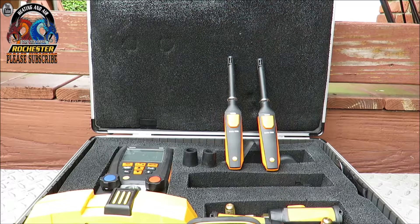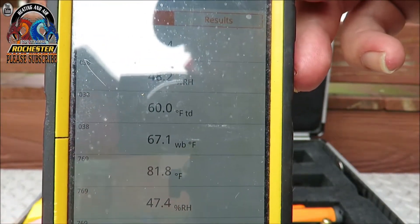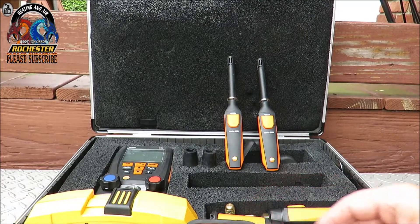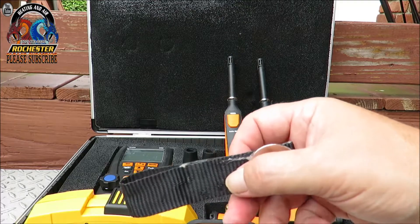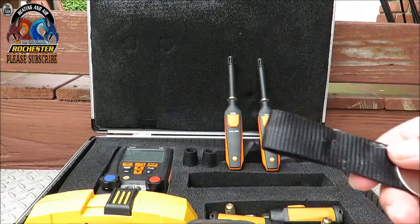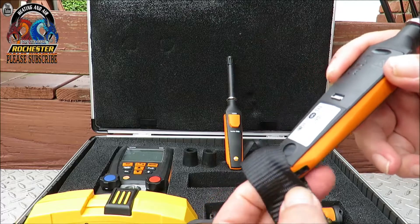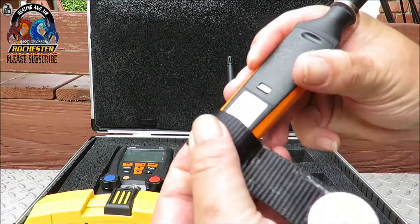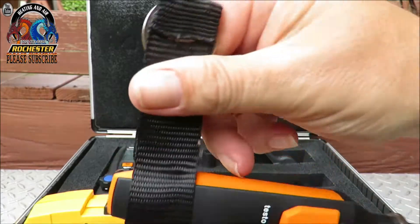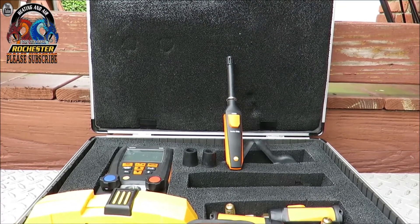I went ahead and fired up my 605i temperature probes. I opened my app — and it's actually reading. I was just trying to prove a point that the magnets really didn't do anything to the readings. Before I pop them in the ductwork down there, I made up a couple of these little webbing straps — like the webbing we use to hang flex duct in a crawler or attic. I made it kind of tight, so you just slide the deal in here like so, and basically you're just going to hang it from your return grill. I also made one with a hook on it. Let me go down there and show you real quick on the duct.